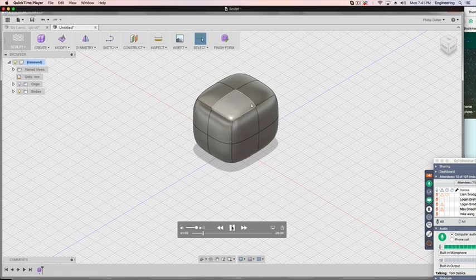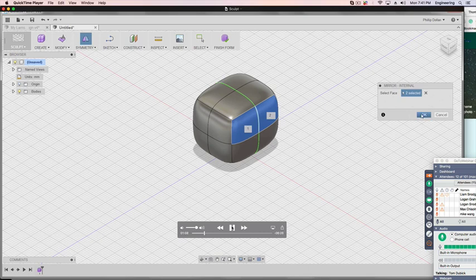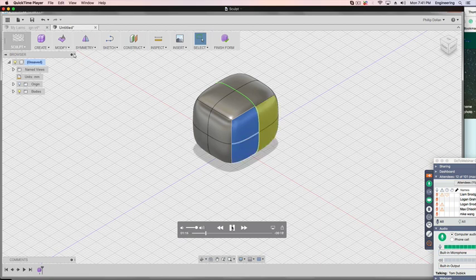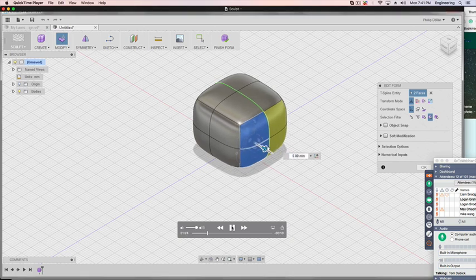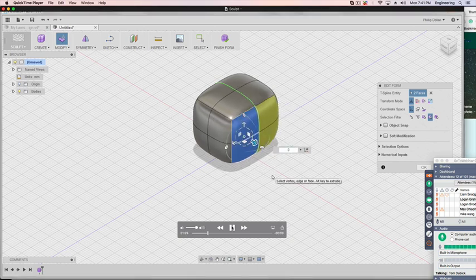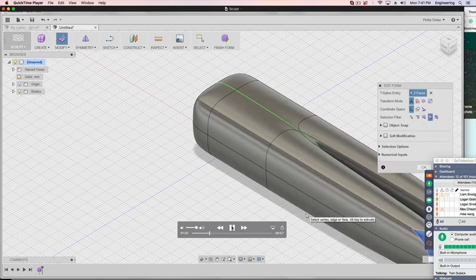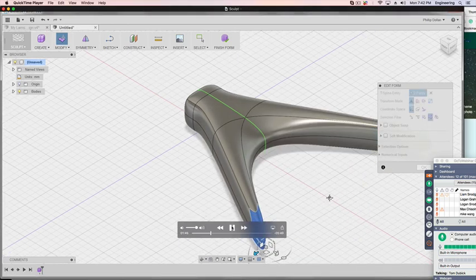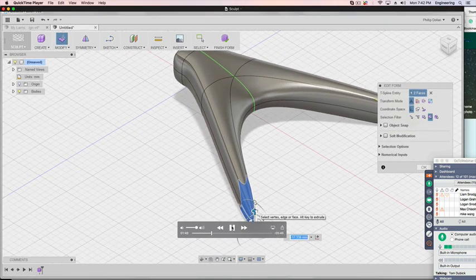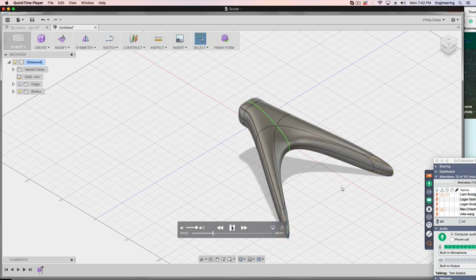Now what I've created is a T-spline freeform model, and it consists of faces, edges, and points. Something that's very useful when you start your designs is to add symmetry. So I've created symmetry. You can see that green line through the middle of the model. When I select one side, because of the symmetry, the other side is also selected. If I go to modify, I'm going to select edit form, drag that manipulator, and you can see it's actually stretching the model out. That's not what I want, so I'm going to set that back to zero, hold down the Alt key. Now when I drag, because of the symmetry and the Alt key, I'm adding on those legs of my tripod, which is what I want the stand to look like. I moved it up 125 millimeters, and then 75 millimeters. And I'm dragging it down, and this is a negative value, so it's negative 50 millimeters. Click OK. So that's a good start for this tripod that we're creating.